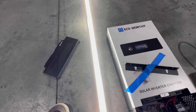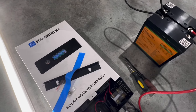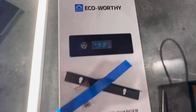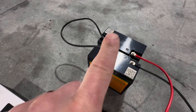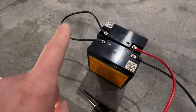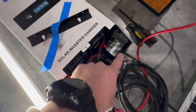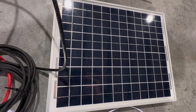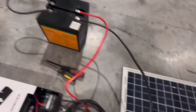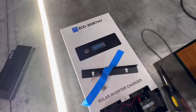You can run this LED strip — this is a 48-inch LED that's going to light the container up really well. It probably pulls around five to eight watts; it's LED and very bright. So it'll run this light for days with no charge, and charging batteries and things like that will work great. With a 24-volt system, we've got our batteries wired in series: negative-positive jumped over to a negative, then the positive and negative going to the inverter — battery input — and then the PV or solar panel input.